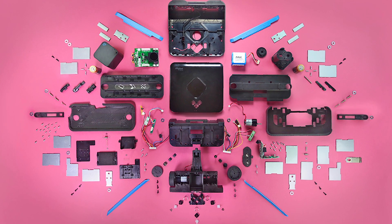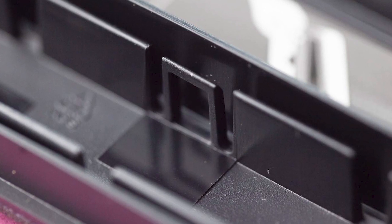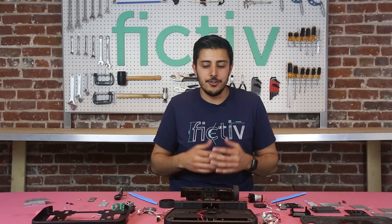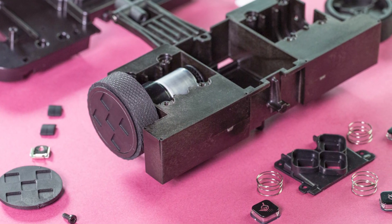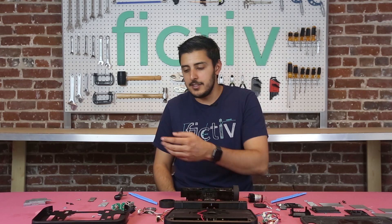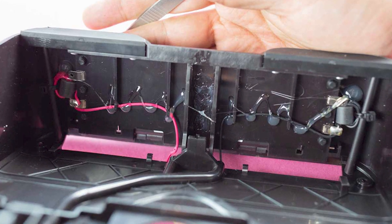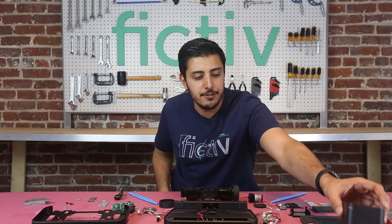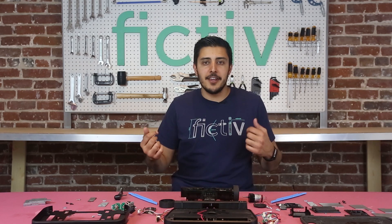Overall, the product was actually pretty fun to break down. Nothing surprising — this is about a $300 consumer electronic product, so there are a lot of design choices made to simplify things. You're not going to add lidar or a camera-driven approach to navigation; you do it through simple sensors that act together to give this product a little more intelligence than you'd expect. You see a few design choices like the heat staking of the magnets and gluing foam on post-manufacturing instead of over-molding. The mechanical portion, which we focused on, is quite simple. That was a teardown of the iRobot Brava 380T — if you enjoyed this and want to see others like it, subscribe below.